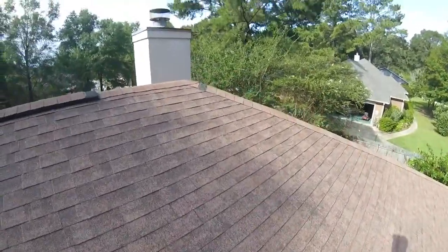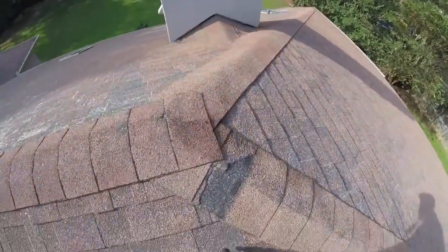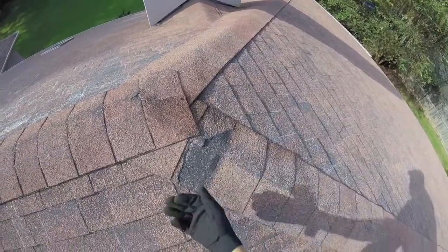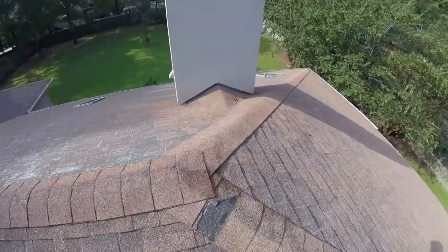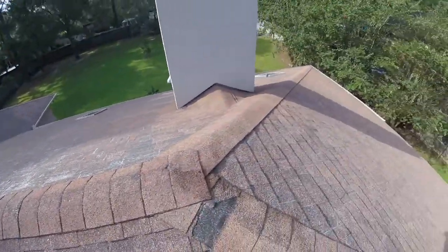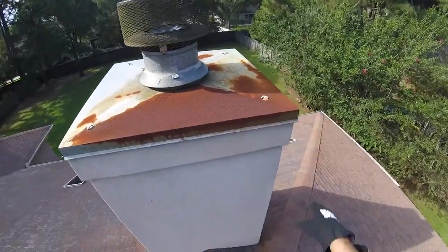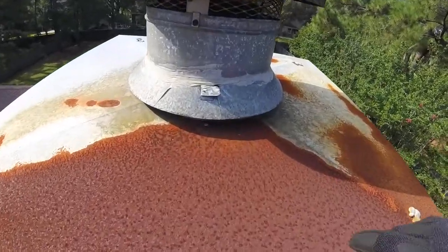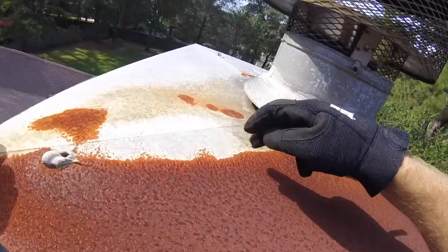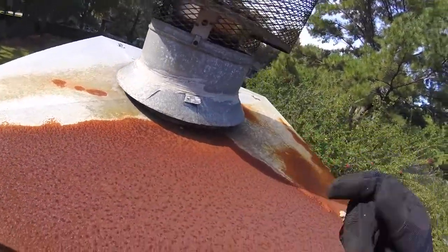And this is going to be common all the way across the roof. The shingles are losing adhesion now to the point that wind is able to get under here and break these tabs off. Same thing here — could have been a good gust of wind coming out of this direction. The chimney cap is absolutely rusted out; it won't be long before that falls through. So that's beyond the point of surface rust — this is actually going right down through.